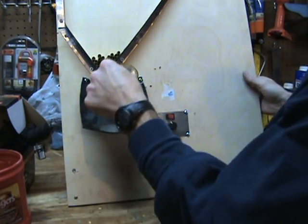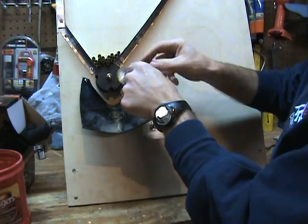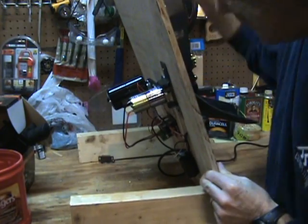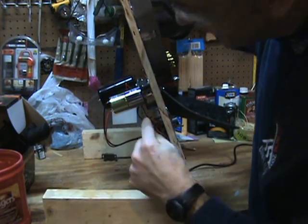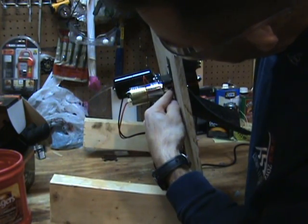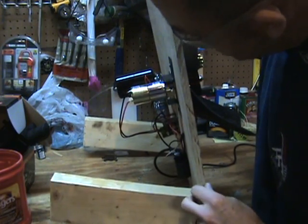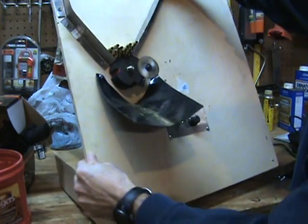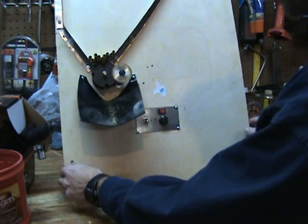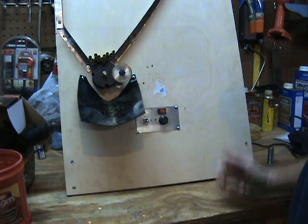I have nuts that I can screw in or out in the board to vary how long the shells come out — that's really the only thing a regular home hobbyist can't easily do. The shaft the drum is mounted on is just a quarter-inch threaded shaft with a set screw in the back where the motor shaft goes in, to keep it all together. Now I can sit back and this thing can pump out more shells in a minute than I can actually resize into .300 Blackout.